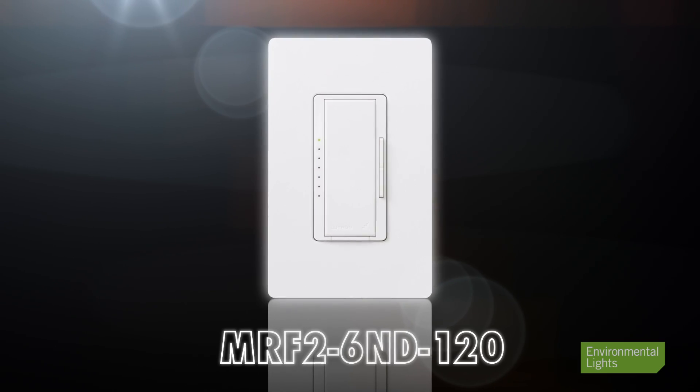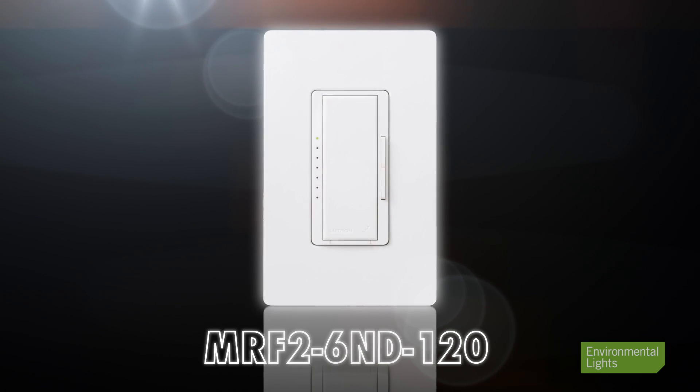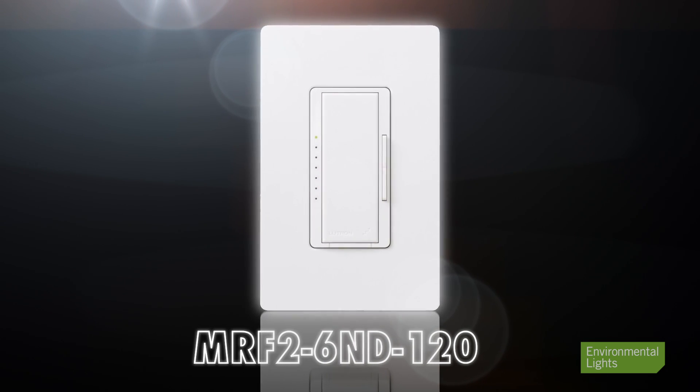They're great, except they have a maximum power of 40 watts, so they're not ideal for large jobs. They only work on a limited selection of specialty dimmers, including Lutron's wireless MLV dimmer, which is a bit expensive and requires a neutral wire in the gang box. The 40 watt size and paucity of compatible dimmers limits the appeal of these drivers and increases the cost of your project compared with other alternatives.